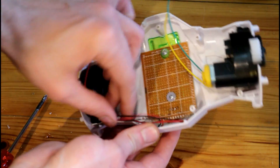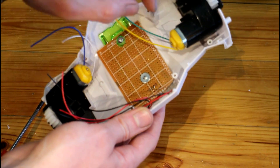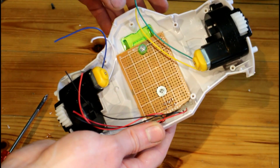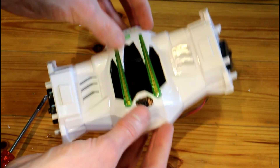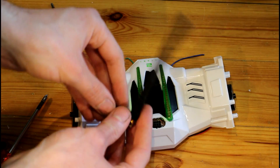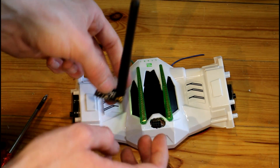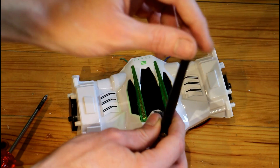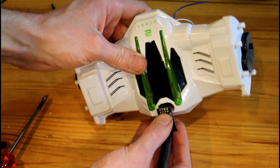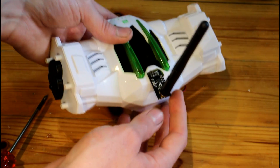There's our PCB screwed in place — you can see there's plenty of space for our microcontroller, dual motor driver, and we'll put in an accelerometer to tell us when we're upside down. On this side we have the socket for the radio module. I can't find the smaller module right now, but you'd just plug in the smaller module with the little PCB printed inverted-F antenna. We won't have the big long antenna because it would hit the wheels — you simply plug the radio module in like this, and the antenna will be pointing out this way for a good radiation pattern.